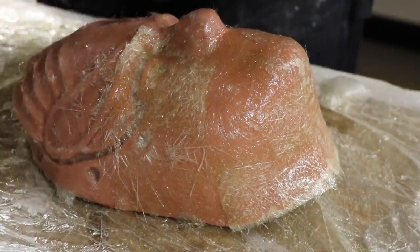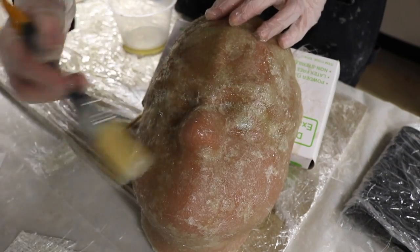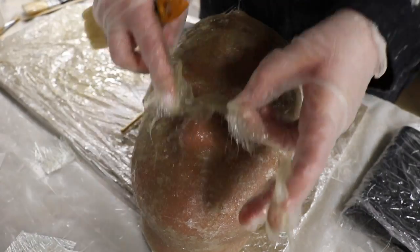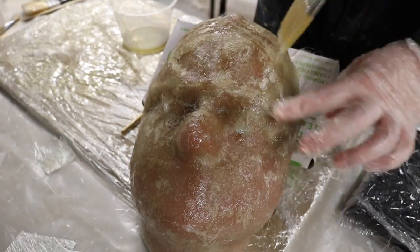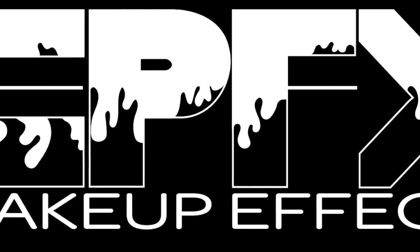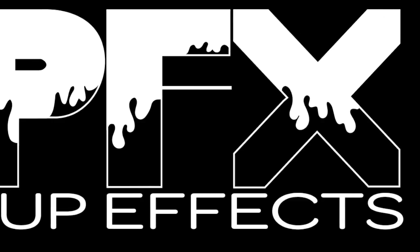I applied four layers overall; with the matting I applied two layers. The final layer is going to be fiberglass tissue, to make the outer mould smoother. To apply this, use the same saturating and stippling method as before. Leave the mould overnight to fully cure. Thank you for watching my tutorial and check out part 2 where I demonstrate how to break open your mould.